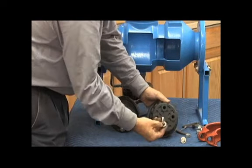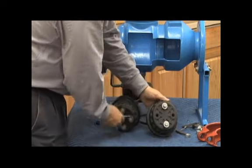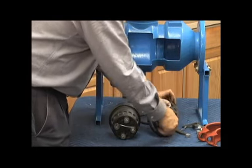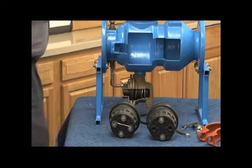Line up your bolts. O-rings on the back side of each of the bolts. Go ahead and put your bolts together. First check, you can see the four bolts there. Same story. You do not release the spring tension for the average repair, but by removing those bolts from the back side, all four of them, allows you to rebuild the check.